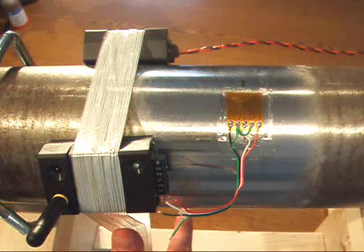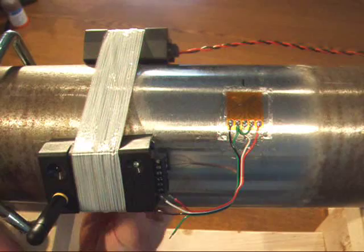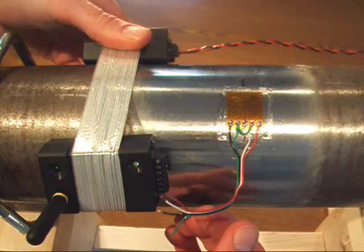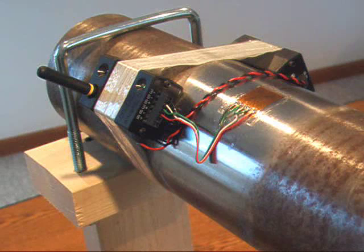I have enough wraps. Cut the tape. Now I can attach the lead wires and the power wires to the transmitter terminals. I've already attached the lead wires from the strain gauge to the TX10K transmitter.